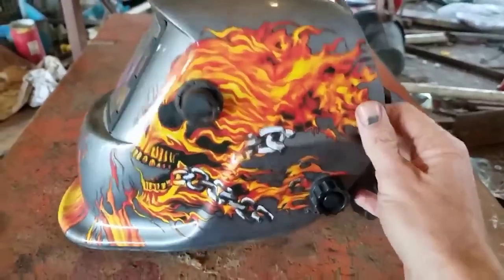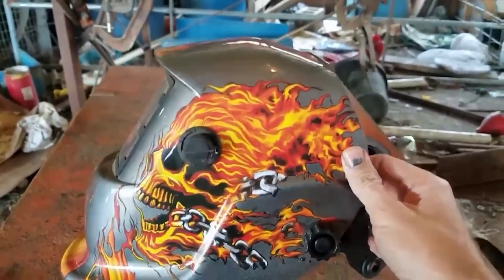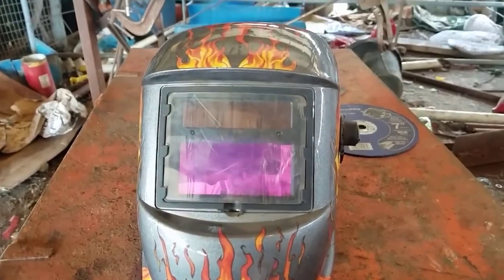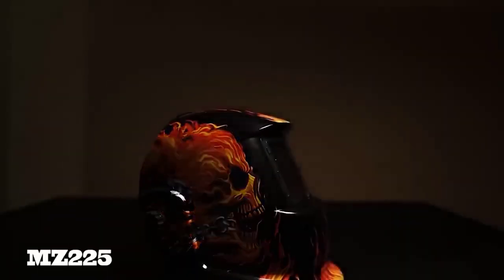And the next in line is a welding helmet. It is used to protect the eyes during welding work from spark spray, as well as from bright light that can damage the retina. An automatic light filter adjusts to the light level and reduces the effect of harmful UV and IR light. A convenient head cap allows you to secure the mask in seconds, leaving your hands free and your head free to rotate 180 degrees.